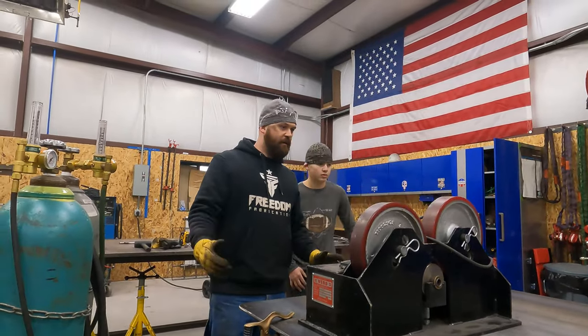Okay, so for those of you who don't know, the center drill really serves two purposes. It can get you centered exactly on your center pop. The other purpose it serves is when you first start drilling, it helps so that the drill bit doesn't wander. So it keeps it centered right where you want it, just in case you were wondering.